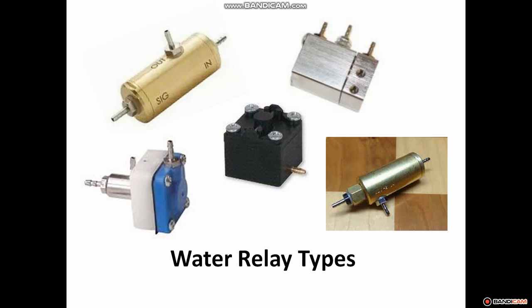Our valve looked a little different, but these are all water relay valves. On this one, an air signal goes to this cap, water sits on the end, and the outlet is in the middle. Similarly here, you have water coming in, air signal coming in, and water out. Water flows from end to center. This is a unique pinch block style — when air signal is applied, a pinch bar is released, allowing water to flow freely through the valve.